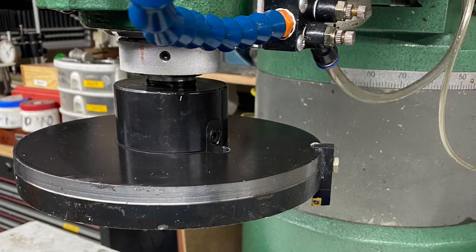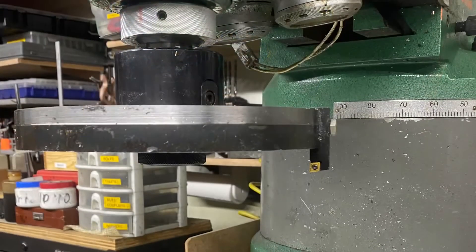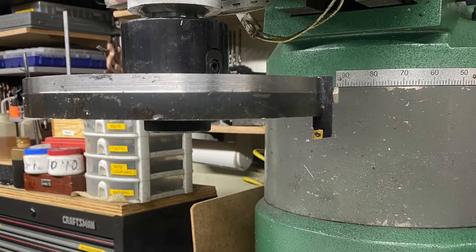I haven't tried it yet but got it built. I took all those hoses away from there — they were just asking to get caught and flung in my face. It's probably about seven and three-quarters inch diameter that it'll cut. There's just a quarter-inch aircraft bolt holding it on; I'm gonna order some drilled-head ones and safety wire them. Don't want that cutter coming flying out at me. We'll give it a try and see if it works — thanks for watching.